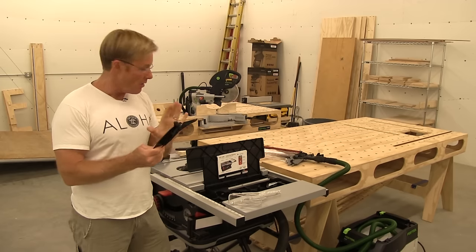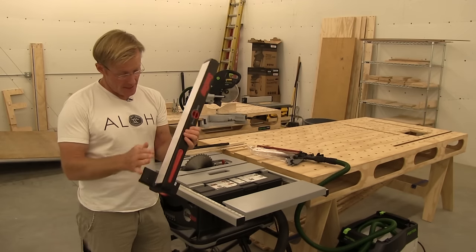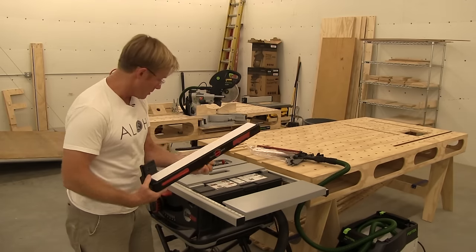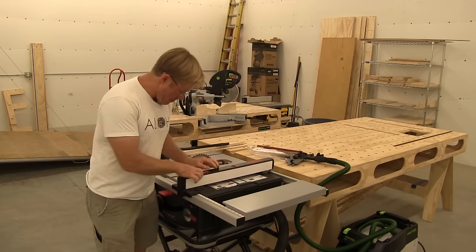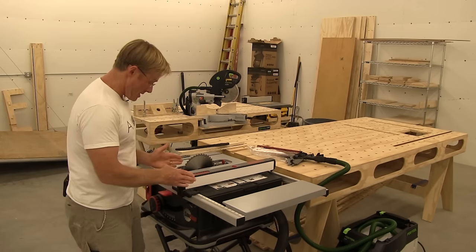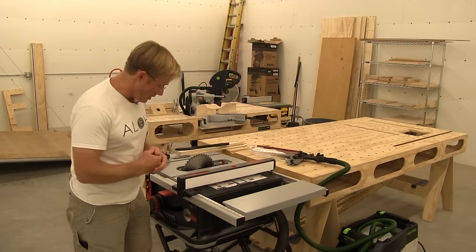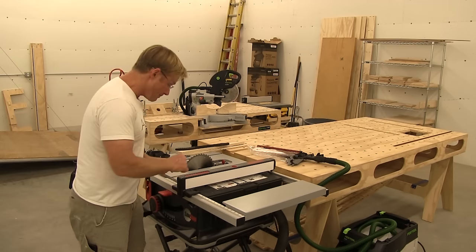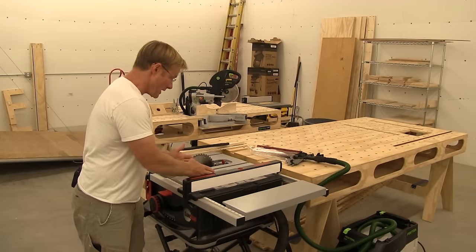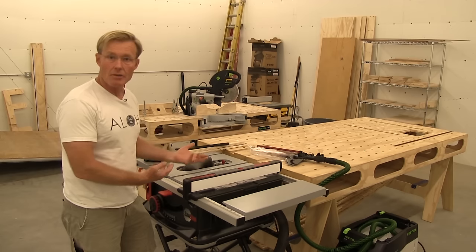All the little parts and pieces are done really well. The fence is a really well-made fence. It's got plastic applications on the side which help when you're pushing material through. It's got a single contact point on the outside edge, which you can square up and adjust the pointer for a precise cut. I haven't had to adjust mine — it came from the factory calibrated, and where I set it, that's the cut I get. The lock is just an easy push button and it keeps parallel very nicely. Because it's not attached on the back side, it makes it easier to take off and on and make adjustments.